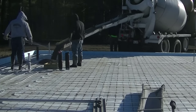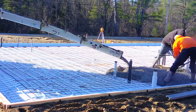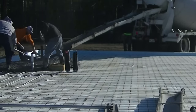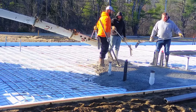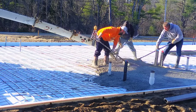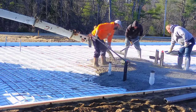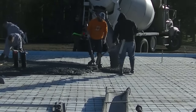Hey guys, Mike here — thanks for stopping by Everything About Concrete. My channel is all about concrete. Today we're pouring a big insulated house slab. The concrete is a basic 3500 psi mix with fiber mesh and water reducer in it, so we can pour a pretty loose slump — up to about a seven slump with that water reducer, no problem at all. The slab itself is formed with two by twelves.